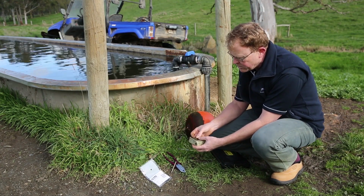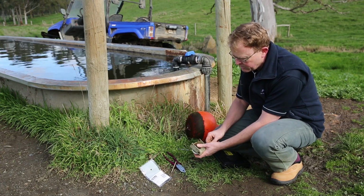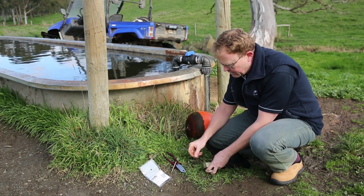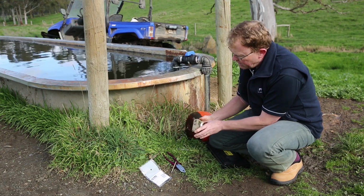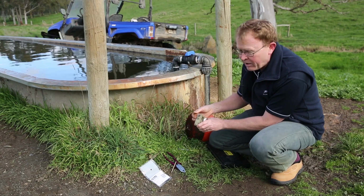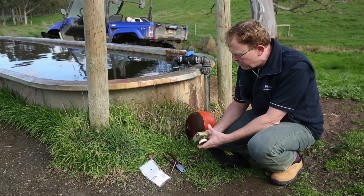Reassembly is very straightforward, just the way it came out. Put the flapper into place, slide that clevis pin through, like that, just line it up there, and put our first R pin back in. So there, just get the R pin back in. I recommend, rather than just go back on one location, I push it the whole way through, so should cattle want to play with it, it gives you a bit more reassurance that it's not going to come loose.